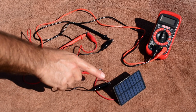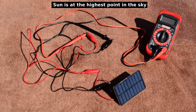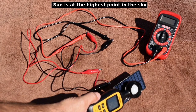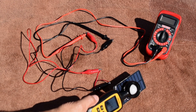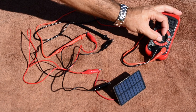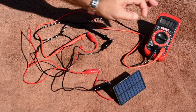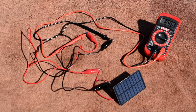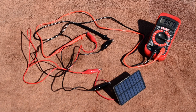The mini solar panel is pointing directly at the Sun and it's at the correct angle. Let's take a lux reading — we're right around 76,000 lux. Now let's take a voltage reading and we're at 4.74 volts. Moving over to milliamps, we're looking at right around 85 milliamps of current from this panel at 76,000 lux.